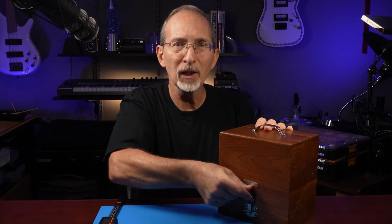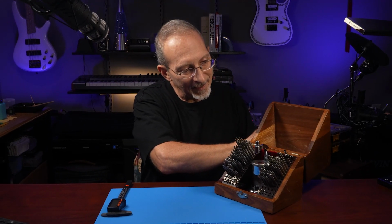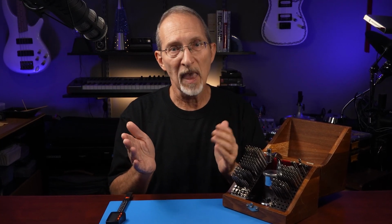So, what have I learned buying this staking set on eBay? I think the number one takeaway is there's no replacement for buying a set that's in good condition in the first place. This is a precision tool, and any set requiring aggressive rust intervention might lose its accuracy. Second, a fellow watchmaker that's much wiser and older than me suggested that it's better to get a good basic staking set than to spend top dollar on an all-in-one staking and jeweling multi-purpose tool. If you'll be setting jewels, a dedicated jewel press will give you a higher degree of control and versatility.